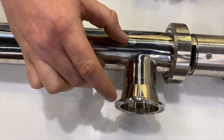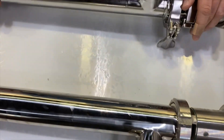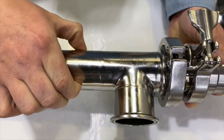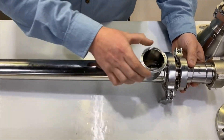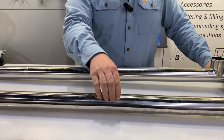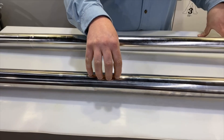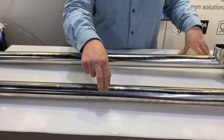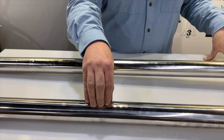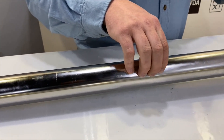Moving down to the discharge port, you can see the diameter on the F560 is necked down and then comes out to a two-inch tri-clamp. On the Visco Power we have a full two-inch to match the diameter of the tube, also standardized on a two-inch tri-clamp. For the tube itself, the F560 has a 5426 designation — 54 is the diameter of the pump tube, 26 is the diameter of the rotor — also available in a 5021. For the Visco Power, we standardized on a 53-millimeter tube.